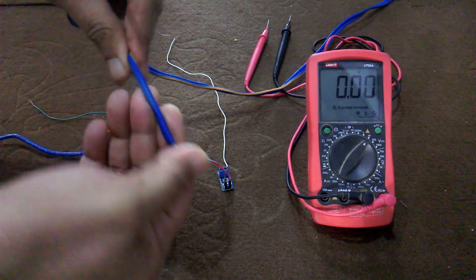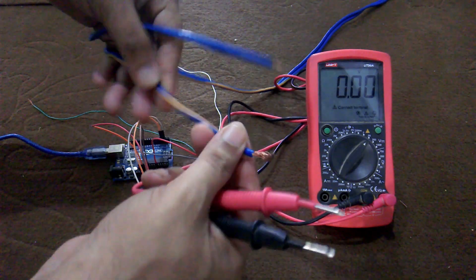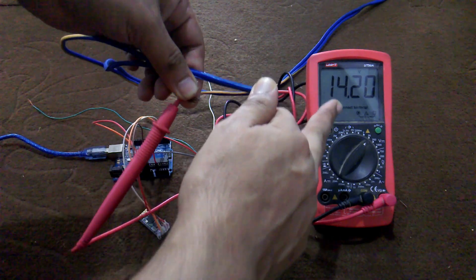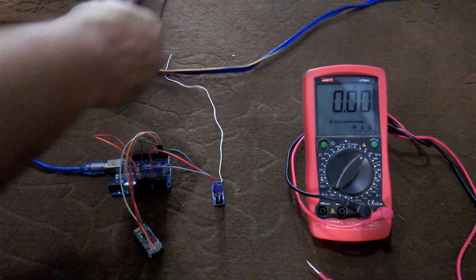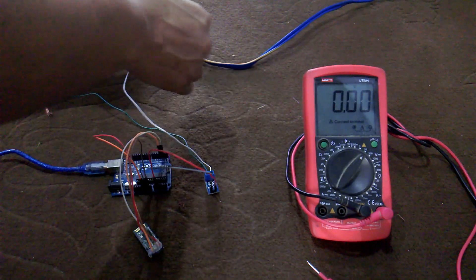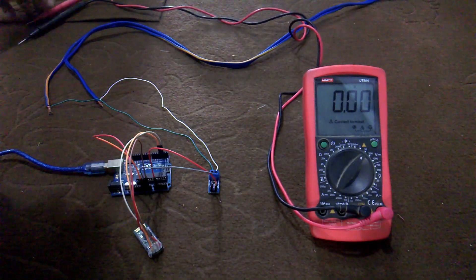As you can see, these are the two wires coming from the battery — the wire with the red line is the 12-volt wire and the other wire is the ground wire. Let's connect a digital multimeter to check the voltage — as you can see the voltage is 14.2 volts. Now let's connect the voltage sensor with the two wires coming from the battery: connect the green wire with the 12-volt wire and the white wire with the ground wire. Connect an additional multimeter so you can compare the voltages.